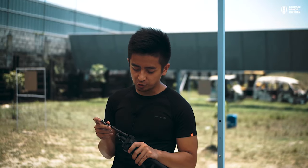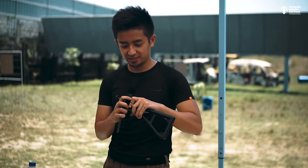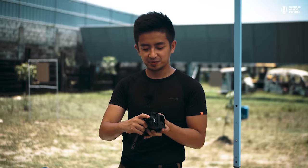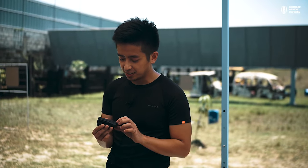Another advantage this recoil system has over the AR buffer system is that you can fire it while folded — fold the buttstock and the buffer doesn't extend beyond the plate. The bolt rides on rails inside, similar to the MP5, giving you the recoil mitigation of an MP5 on a system with an AR-15 style lower receiver, making it easy to shoot and perfect for competition or tactical use.